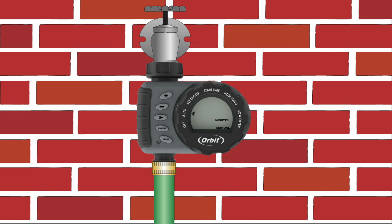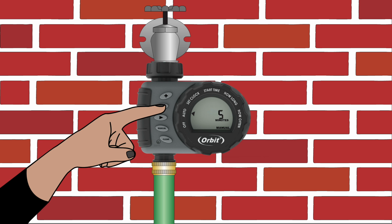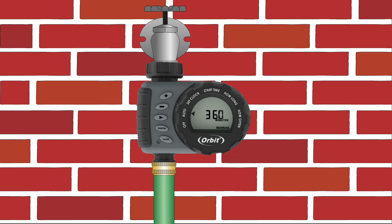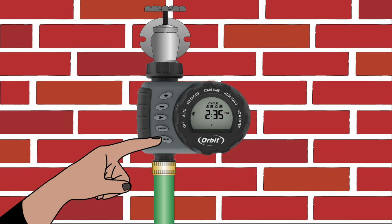When you first press the manual button, the timer will display 10 minutes. Using the plus and minus buttons, you can select watering times from 1 to 360 minutes. Once watering has finished, the timer will automatically resume your program watering schedule. Note, if the manual button is pushed and no selection is made within 5 seconds, the timer will water for 10 minutes. To stop manual watering at any time, press the clear button.